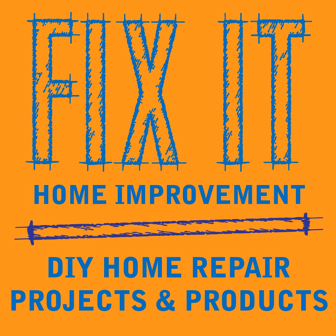I spoke to Ryobi — it's R-Y-O-B-I, pronounced Ryobi, not Ryobi. Some tips from Ryobi: chainsaws are designed for two-hand operation only, and even left-handed people need to use it right-handed for the safest operation. When holding it, you don't want to be in line with the blade — keep your body offset slightly. If you do get kickback and it comes straight up, you want it to go to the side of you, not toward your head. If your right hand is gripping the back handle with the trigger, extend the saw straight out from your right hand so it's not lined up with your face.